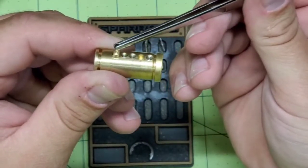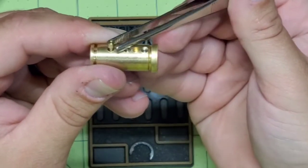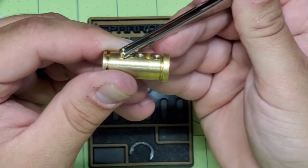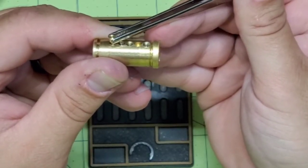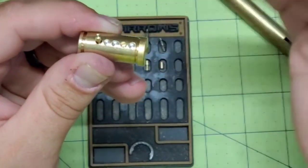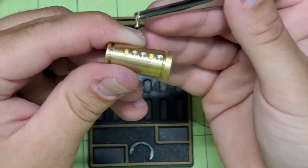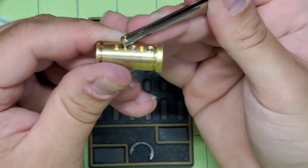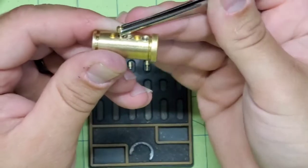But you see how when it sits in chamber five, it is right up there on the shear line where that spool starts. So the whole thing's going to play into it. And if you think about when that gets picked, as you go over that fat waist, it's going to cause that core to counter rotate, and then it's going to drop back in, which is potentially going to make whoever's picking this think, okay, I've got that one set, move on to another one, when in reality it's not set. But if something like this were in chamber four, you can see that none of that two-step of the spool is going to have any factor whatsoever in how this is picked, other than a little bit of the spool.